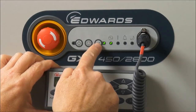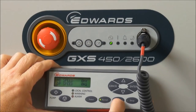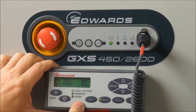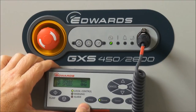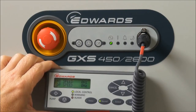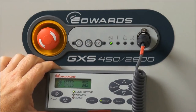Only if control is released on the dashboard can the PDT take control. I press the control button and now have local control — I could run the pump with the PDT. Of course the reverse is true: if the PDT is in control, it's not possible for somebody to use the dashboard to run the pump — the button push is ignored. Only one thing can be in control at one time.